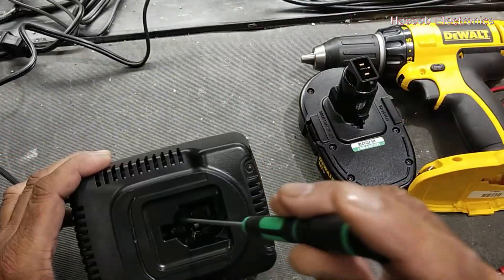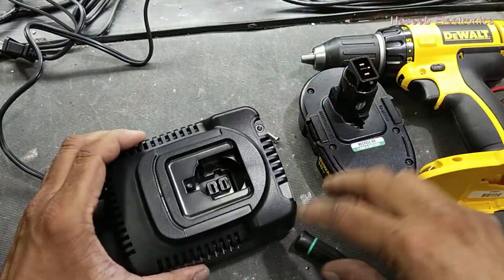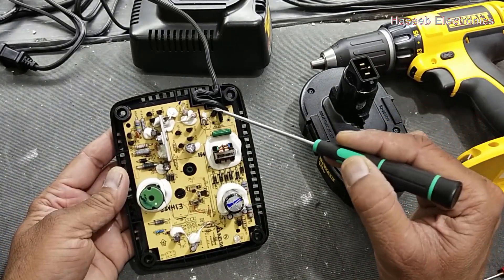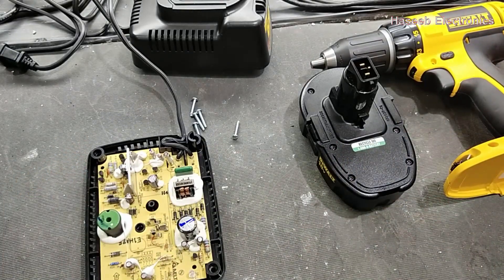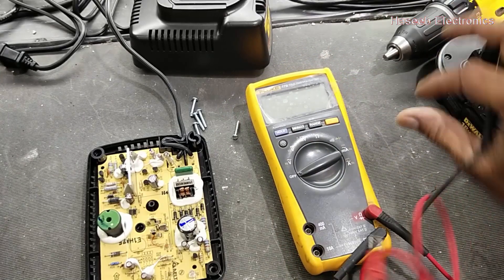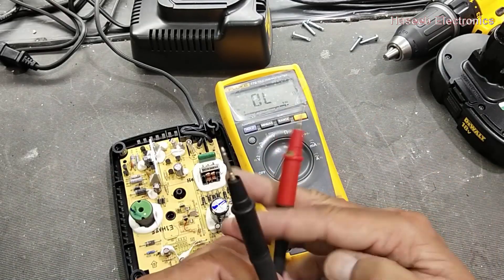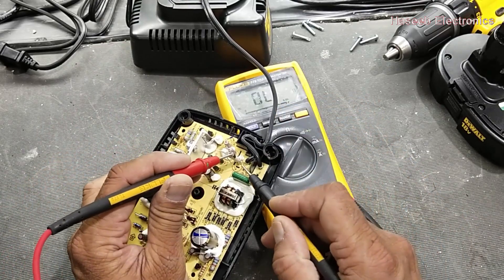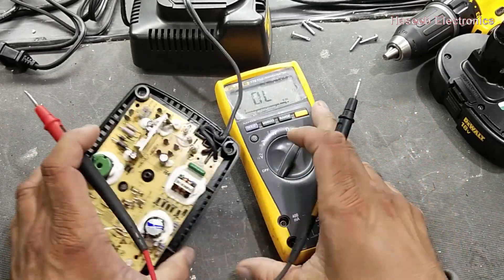The fourth and fifth screw are here. If you see the charger here, there is an input circuit fuse — so the fuse is here, the first point we have to check. That is the fuse. Then we will continue further. Set the multimeter to continuity and connect across the fuse. The fuse is open — this is the most probable cause for any mishap.